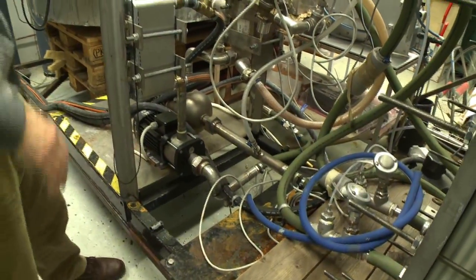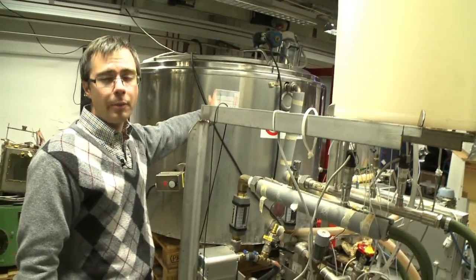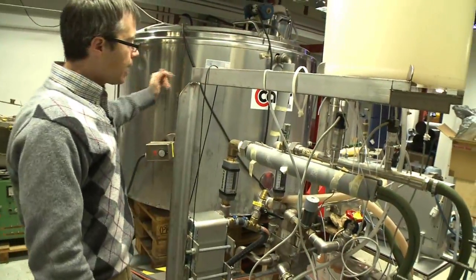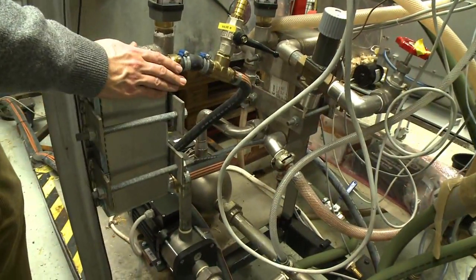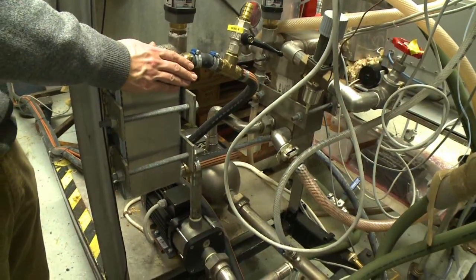On the hot feedstock side, we fill up the stainless steel tank with water. That is our primary feedstock — just city water. Sometimes we will dose it with salt. That is being pumped through the system. We have a plate-in-frame heat exchanger to provide heat to the feedstock, and we also have immersion coils to electrically heat the feedstock.